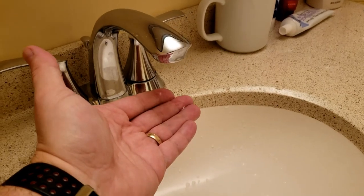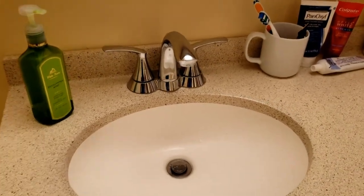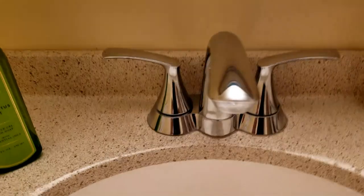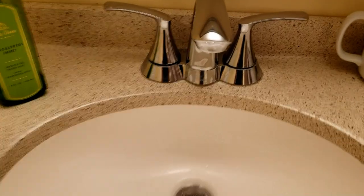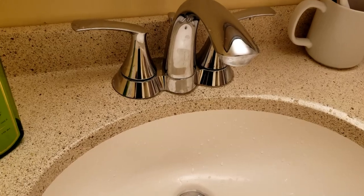The water is warm so it's on the hot side. First, what we're gonna need to do is shut off the water supply to the hot side. You can feel the pipes and you'll know it's the hot or cold side if it's not labeled or you don't have that red or blue indicator. Let's release the pressure to verify it's the hot side — it stopped dripping. Cold side is still working.